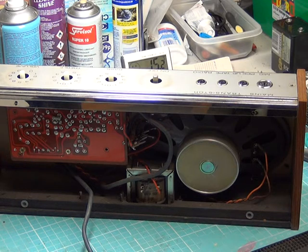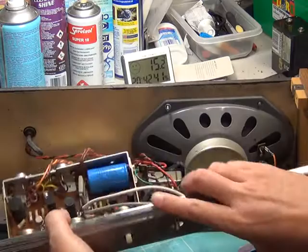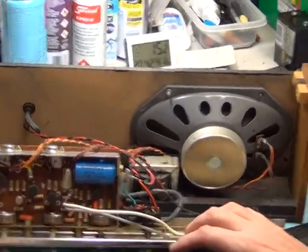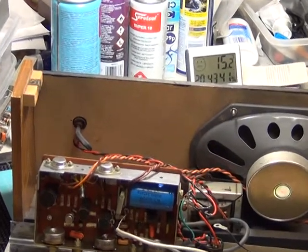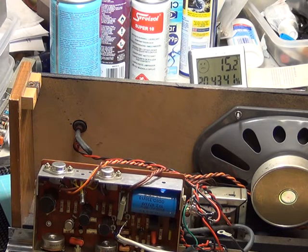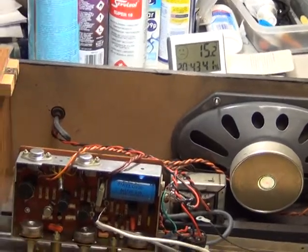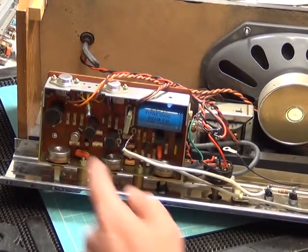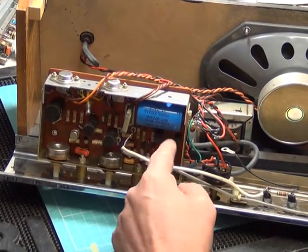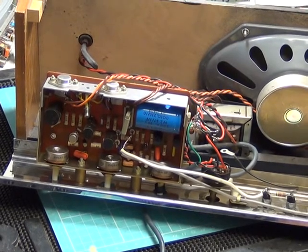So there we are with the back off and the knobs in the dishwasher. It is the same module, yes. You can see it's got the same 8x5 speaker, and it's got those nasty black capacitors. Just point to some of those black capacitors which we hate — Hunts and all that. We'll get rid of that blue one as well, just like we did on the ultra. And then the job, hopefully, will be fab and brill.